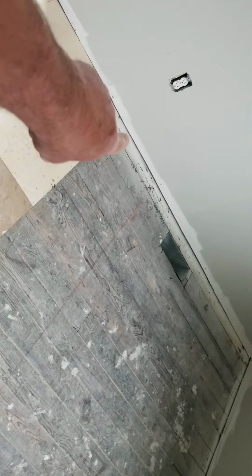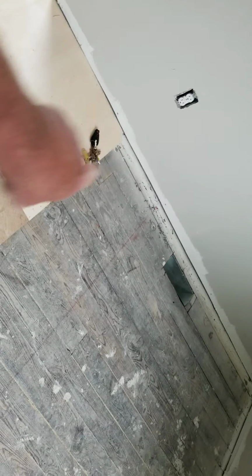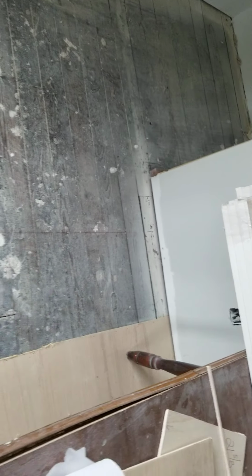And then after that gets in, we can make up our floor leveler and pour this in here. Like I said, we got to cover up the holes and the openings. We got to make sure that no leveler would get out through there. And this is a big opening here, the crack there, and no leveler would get out there. And then we'll just go ahead and mix it and pour it and let it sit here overnight. This will harden up. Don't worry about that.